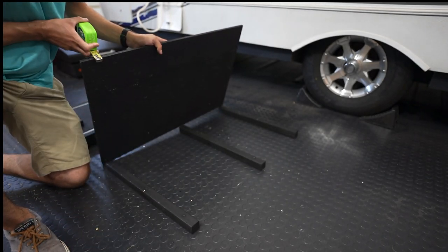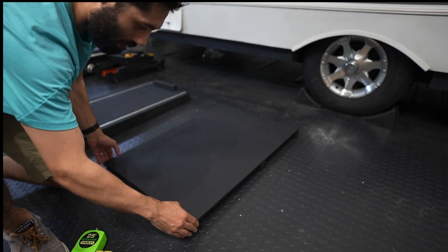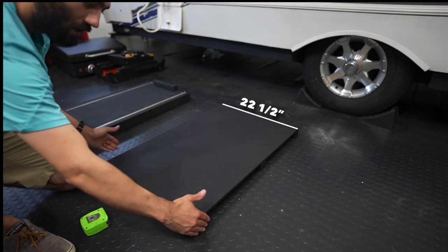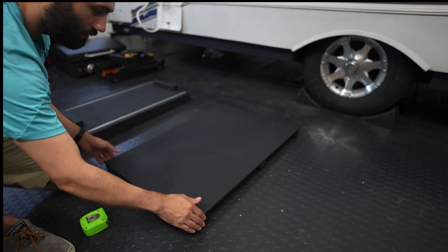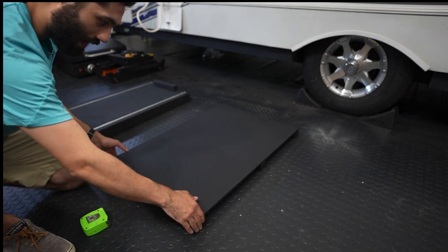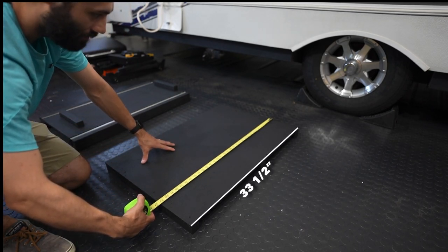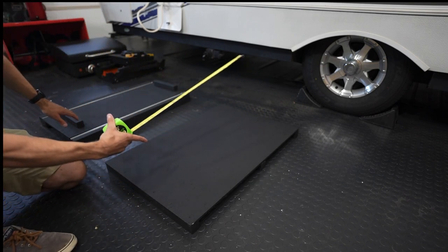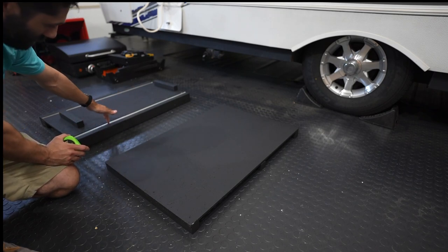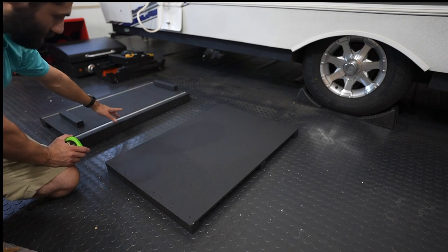The two by twos and the width of our plywood are 22 and a half inches, and this is dictated by the width of our box - so if your width is different that might be different altogether. The length of our platform is 33 and a half inches, and the reason it's 33 and a half is because the slides I purchased were also 33 and a half inches. Essentially the slides dictated the length of everything. The reason I went with 33 and a half inch slides is because our cooler is about that long, so I needed something a little bit longer so the cooler could fully extend out of our pop-up.